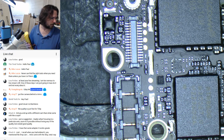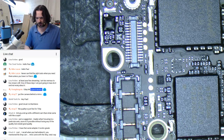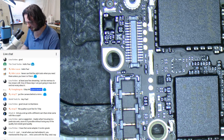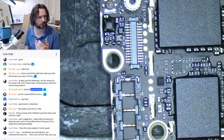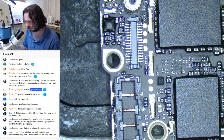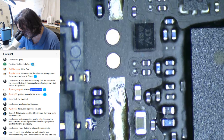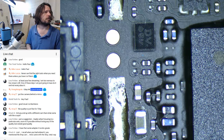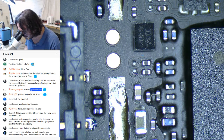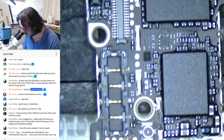Maybe I'm focusing on a particular area, zoom in if possible, without losing any quality. The only thing I've got to say is, this is an autofocus, so I do tend to notice that when you zoom in, the camera doesn't track true with its focus, not as close as I want. So I'll do a zoom in on something here. Okay, obviously that's out of focus. Like, to me, that's dead set focus. And I suppose it's not too far off for you guys. I suppose it's tolerable. This has got the 0.7 Barlow on it, which I find is a really good combination.